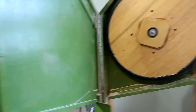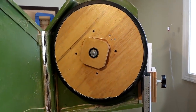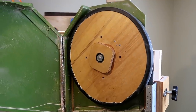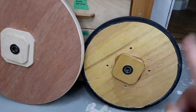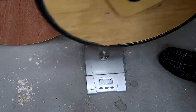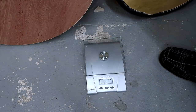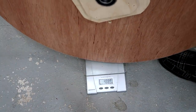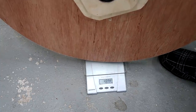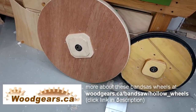This one has solid plywood wheels. For the bigger bandsaw the wheels actually have 70% more area, so the weight becomes more of an issue — but if you wanted to build a bigger bandsaw with solid plywood wheels that would work just fine, I just want to try something else. Here's one of the new wheels compared to a 20-inch solid plywood wheel. The 20-inch solid plywood wheel weighs 4.2 kilograms, and the 26-inch hollow wheel weighs 4.9 kilograms — that's without the inner tube. So considering this wheel has 70% more area and is also thicker, that's not too bad.